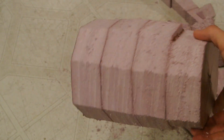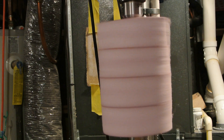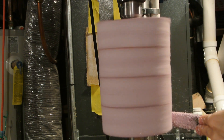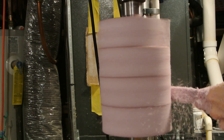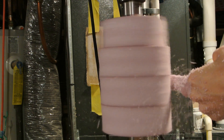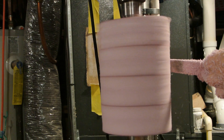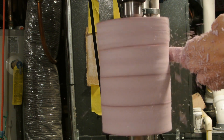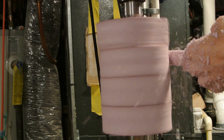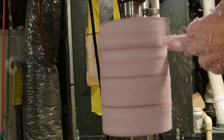This was repeated for all four corners, after which the billet was placed with the dowel rod in the drill press. A large-tooth metal rasp was then used to smooth down the edges and make the entire thing perfectly circular. At this point I did not start the tapering process because I wanted to get the final diameter nailed down — it was just the diameter at which it became a perfect circle. Kind of fun to watch the chips fly off.